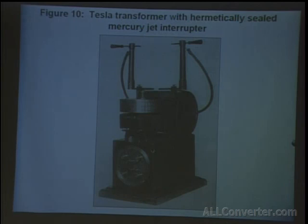The mercury brake is of a kind described and operates on the principle of a jet, which establishes intermittently contact with a rotating wheel in the interior of the pulley. So another principle of mercury interrupters is a mercury jet. It's basically, as the mercury is on the outside of the container, there's a little funnel receptacle which catches some of it, goes through a tube, and produces a jet inside. And this jet can spin a fan blade that's held stationary and make and break contact with a fan. So it's basically a fan blade which is moved by mercury, caused by the container itself spinning.